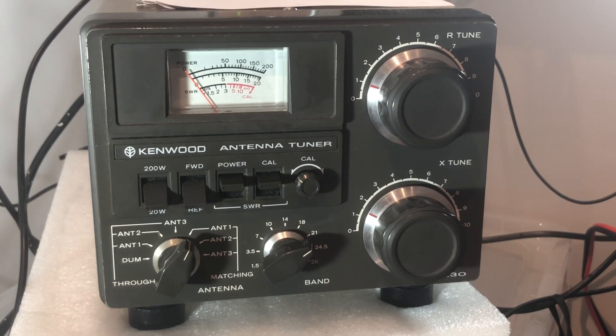I would recommend that you turn the power down in your radio to no more than 5 watts. This tuner needs at least 4 watts to accurately measure. Put it on FM or maybe AM — I use FM to give you a steady carrier, so you don't have to whistle into the mic for a more accurate reading. Choose a portion of the band that is quiet. 15 metres is absolutely dead at this time of evening in the wintertime. So let's press transmit and see what the reflected power is looking like.